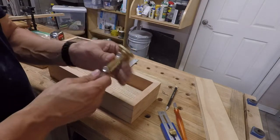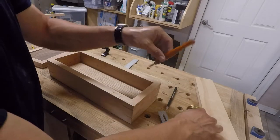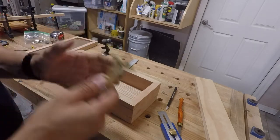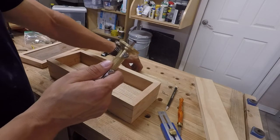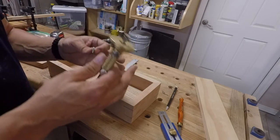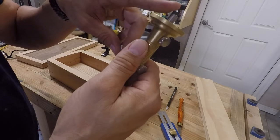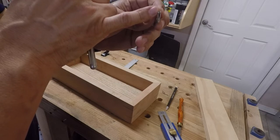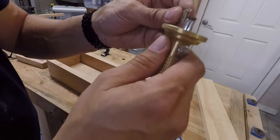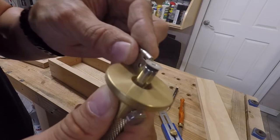The next step is getting this marking gauge - you can buy these off Amazon or your wood stores. This is a great tool for doing this instead of trying to use a knife and line yourself up freehand. The reason it's very useful is because of the measuring itself. Get your hinge and what you want to do is put the hinge against the base plate of the marking gauge and set this cutter head to be half the distance of the hinge barrel - I believe it's called a barrel, correct me if I'm wrong. As you can see, my marking gauge is set up halfway to the barrel of that hinge.